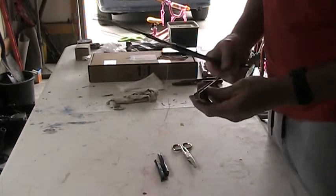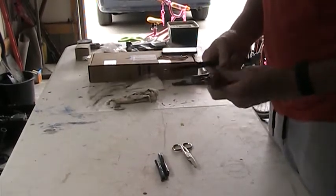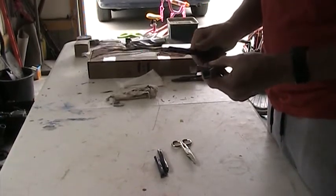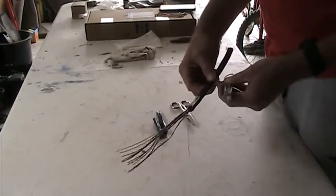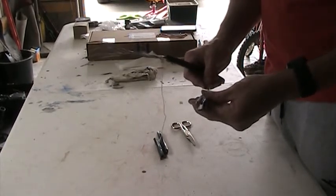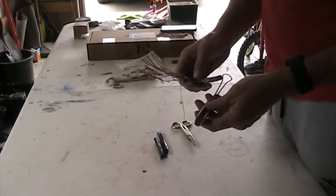Now whenever you have drop troubles, maybe half the time it'll be something to do with this. Either this has come off, or this has slipped loose for some particular reason, or it's broken, and generally speaking that's why your drop is hanging low. Or it's got torn off because it's been contacted by a vehicle or some high load or something like that. But that's drop wire in a nutshell.